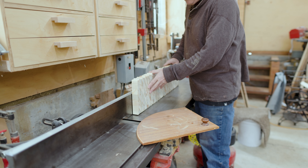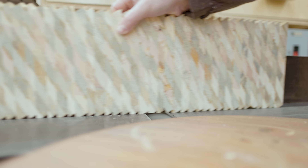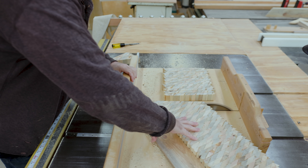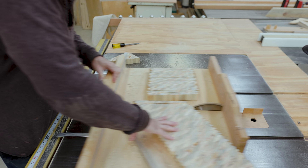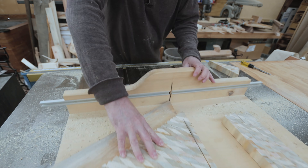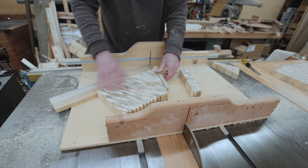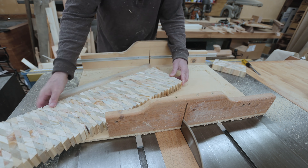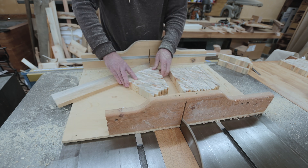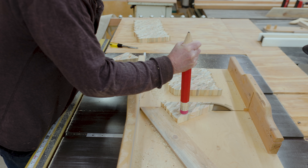This is the first glue-up at an angle. I can then rejoin the edge again — now the edge is getting a little bumpier. I just had to get it to where it was straight and would work with the fence on the table saw. I then cut the pieces at an angle again. Because I was cutting these at an angle, my overall piece was getting shorter and wider as the strips were getting longer, since they're cut at an angle through the bigger strip.